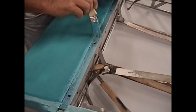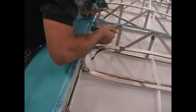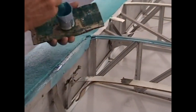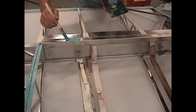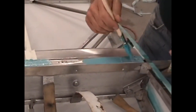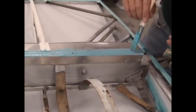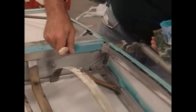After I cut that fabric off, we'll go ahead and wrap that fabric and glue it on the bottom side here too. That really enhances the strength because now you've got a glue joint that's pulling in two different directions — that's a very strong glue joint. If you get some glue up on the edge here, it doesn't hurt a thing — it's all going to be bonded down. The gas tank bay will be left open; the gas tank will be reinstalled after the fabric is shrunk, rib stitching is done, and probably even after the wing is painted.